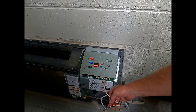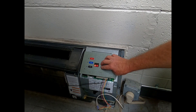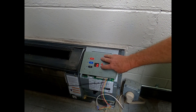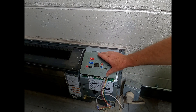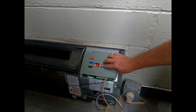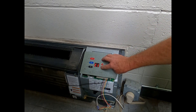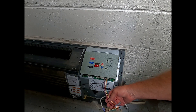Press off, and what's going to be displayed is the word 'on,' which means the wired thermostat is now going to control this PTAC unit. On the other side, if you wanted to take it back to local mode, you do the same: press plus and minus simultaneously, off button twice, heat mode, scroll down to zero, and off — now you are back in local mode. To change it back to wall thermostat, hold down simultaneously, two quick hits of the off button, scroll down to L5, and off. Now the wired thermostat is controlling this unit.